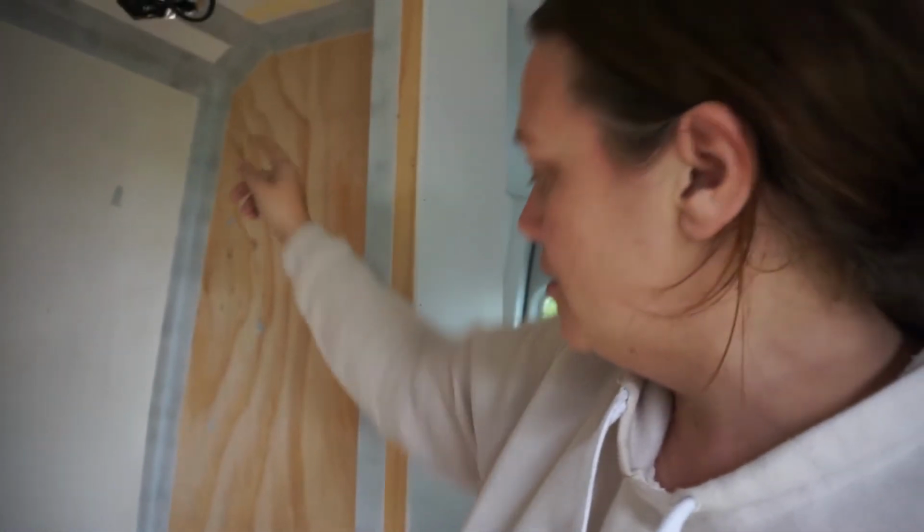So in terms of the stages of building the shower, obviously frame is part 1, waterproofing and getting the space ready is going to be part 2. By the space I mean we're going to put in the sloped drain and all of that stuff. Part 3 I think is lining it, so lining it with acrylic, with tiles, acrylic on the ceiling. And either part 3 or part 4, I don't know how many parts the shower build's going to be because it's all a bit of a process, will be plumbing in the shower head that goes up here, the toilet vent, and finishing off the drain. So that will be parts 2, 3, maybe 4.